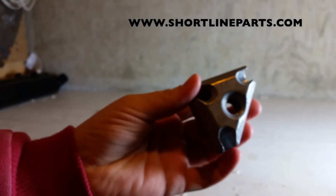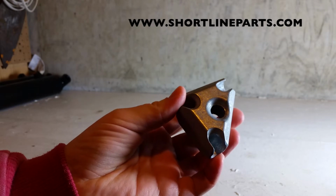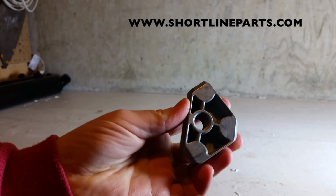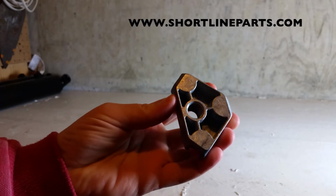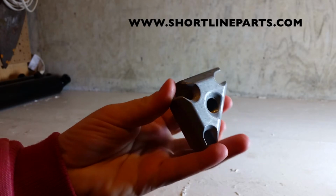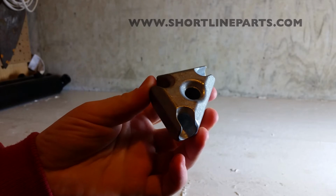This is what's technically called the joint, and this is up inside the joystick base of the current style joystick, and it's just basically a triangular aluminum piece. And because this also is taking stress every time the joystick is used, it also tends to wear out over time.